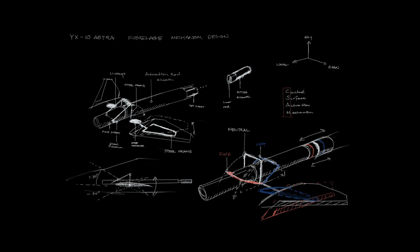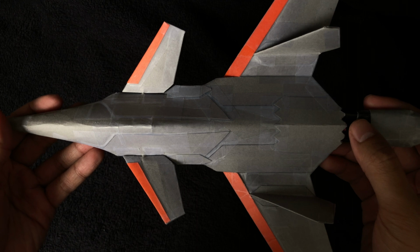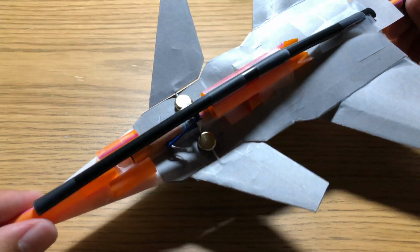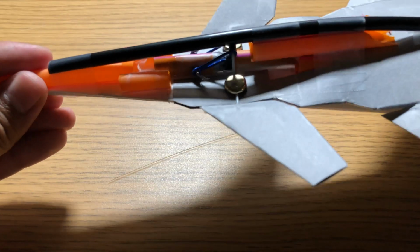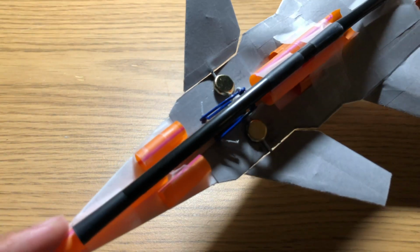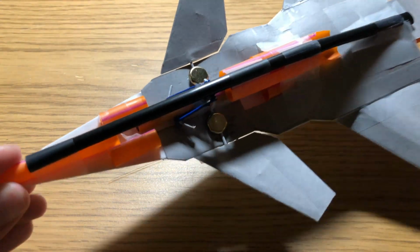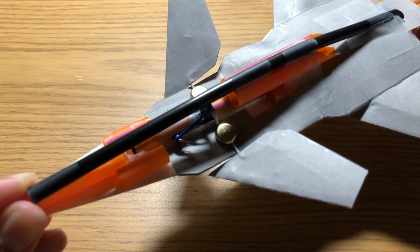For the actual mechanism itself, it consists of a friction lock core, a hinge, and a canard framework. And this took a lot of experimentation and iterations. While I can't show you the internal mechanism here, I will overlay some footage, and basically this design works by a friction lock module in the back, which you actuate forward and back. This rod moves forward and back and moves a hinge link arm forwards and back. And this link and this hinge are made out of stainless steel.